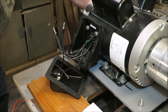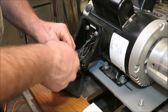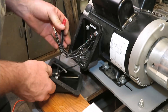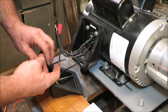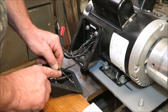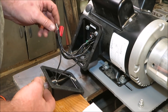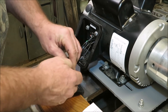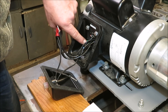So all we're going to do here is wire this one group together — these are just going to be wired together. Now on this we're going to have a neutral wire, the white one. I'm going to hook my white one to P1, so I'm going to hook my white wire onto this which will be my neutral wire. And my hot wire will hook onto here, which will be the black wire. Then I'm going to put a green wire on my ground down here and make sure it's bolted up and tightened down.